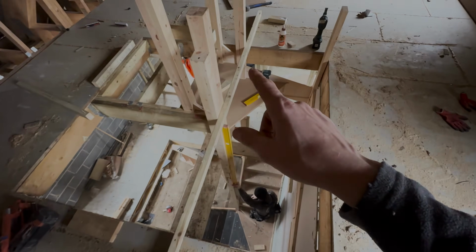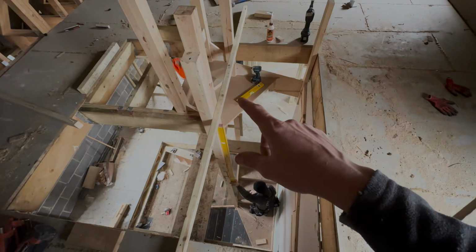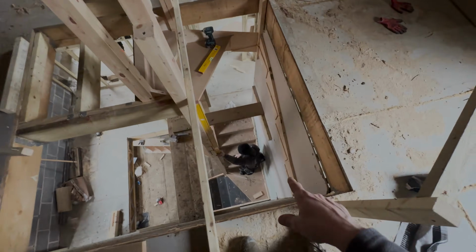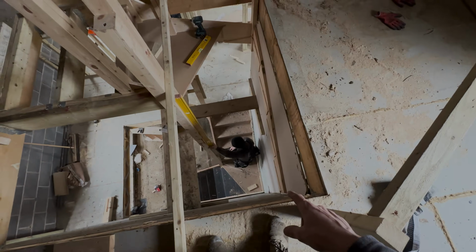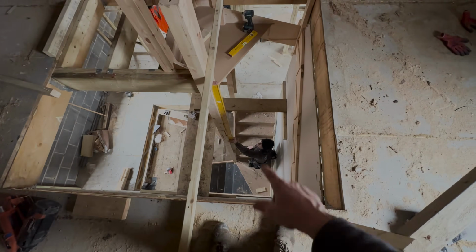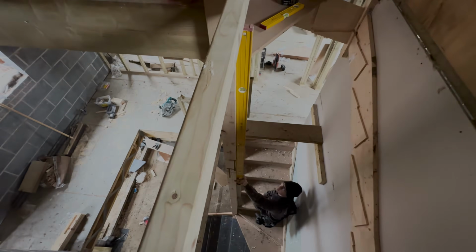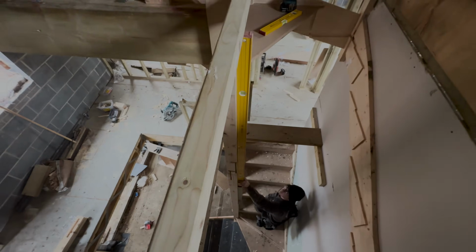We got this string in here with this newel, and we put this tread in, and now we've got this string that comes down here with a 25mm gap on the wall to allow for dot and dab, all the way down to the first set of stairs we put in. You can see us holding a level on there now, and we're bang on, John.